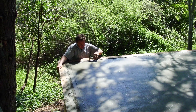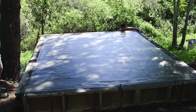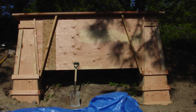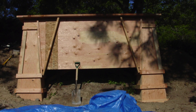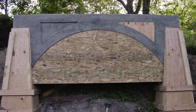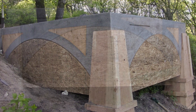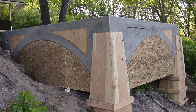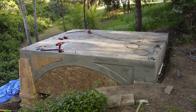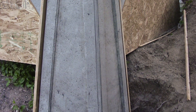On a project like this where the forms support the concrete, it's important for the concrete to reach full structural cure. In this case it was 30 days of anticipation before I could start pulling some of the panels off to see how the concrete did during the pouring process. I actually broke down and took some of the side panels off early — I figured it'd be okay since it's not really part of the support — and I am so happy with the result. All of the edge detail and panel details were preserved perfectly, and the corners came out without cracking.